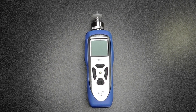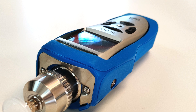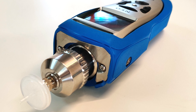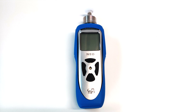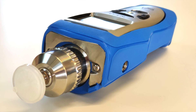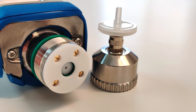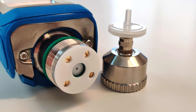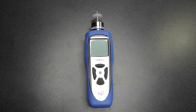Welcome to the introduction of the new NEO photo ionization detector from WatchGas. The NEO comes in four different variants available in ranges from 0.01 to 5,000 ppm, 0.01 to 15,000 ppm, 1 ppb to 15,000 ppm, and 0.05 to 10,000 ppm VOC and 0.05 to 200 ppm benzene-specific measurements. Here we have the 0.01 to 15,000 ppm variant of the NEO.